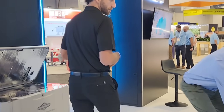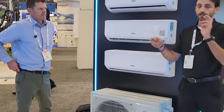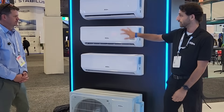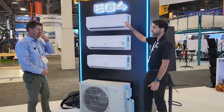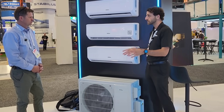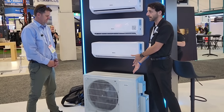For the DIY customers, they may be familiar with the mini split units. We had a one-ton and two-ton unit — 12,000 and 24,000 BTU. This is a 24,000 BTU model. The only difference is multi-zone cooling. You've got one head here and one head here — these are 12,000 BTU each. You can fit two zones on one compressor, or with the 9,000 BTU you can fit three on one compressor. Three small rooms or two large rooms — this can really take the place of central AC in a lot of scenarios.